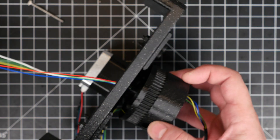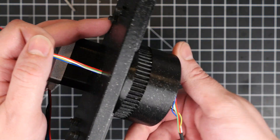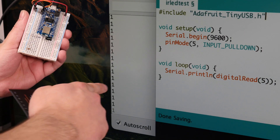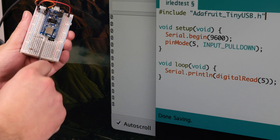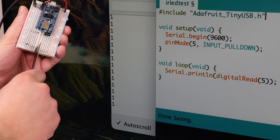The rotating connection between the two parts is working great. The RY housing holds a slip ring, which allows wires to pass through without getting all twisted up — it's secured to the base plate with an M3 bolt. In the future, slip ring connections will be used for shutter control and eventually sending commands to a second microcontroller for the other axes. For now, I used it to connect the RY homing mechanism. Rather than putting a homing switch in the rotating piece, I'm using an infrared LED and photodiode instead — one lives in the base and the other in the housing. The microcontroller detects when the lights line up through little holes in the 3D print, and from there it acts mostly like any other switch. There's still a lot left to get this project to a usable, releasable state, but that's where I'm going to leave it for now.